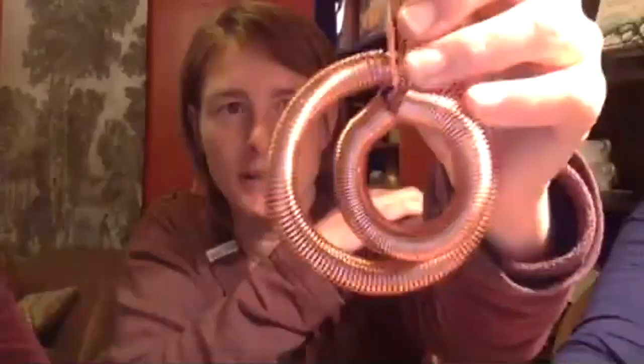Yeah, the way it's wired is all 4 coils are wired in series. The 2 inner springs both flow in the same direction. The 2 outer springs both flow in the same direction, but opposite the inner springs. Here. I'm just holding this up while you're talking. Just keep on talking. And looking at the top, the wires where you'd be connecting to your maggrav should both be on the right-hand side. Yeah. So if I'm looking at it myself, they're on the right-hand side, but since I'm turning it towards the screen, to me they look like they're on the left, but they're not. They're on the right-hand side. No, that's perfect. It's exactly the way it's supposed to be.